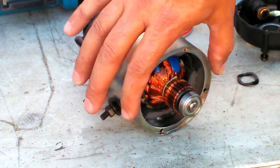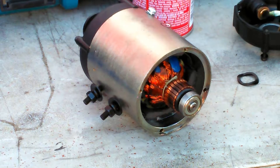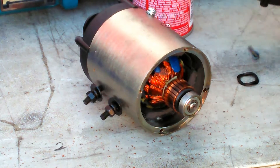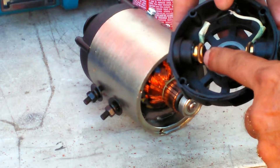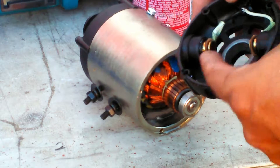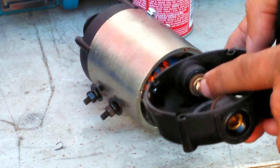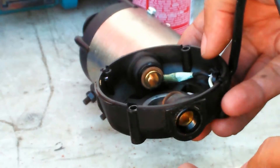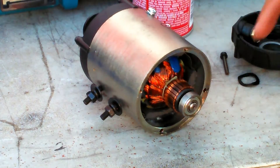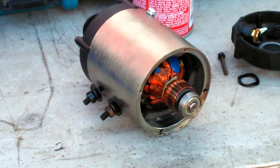The body of the motor is pretty thick stuff - it's a pretty nice little motor for these little cheap lathes. They don't mess around when it comes to the power plant on these. The brushes go into these holes and then come into contact with the motor at this point. You can see where they slide through - they're spring loaded, they come into contact with the commutator and then all the stuff happens. I'll come back on video once I put it back together.